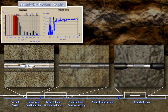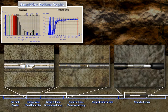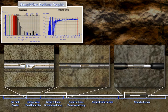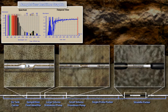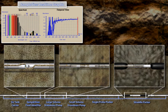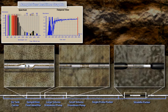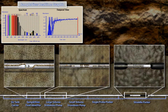The fluid can then be diverted into a sample chamber for retention. In order to obtain accurate PVT analyses, it is essential that the collected samples be as clean as possible to be representative of in-situ conditions. In addition to the optical density measurements, fluid identification of methane, liquid hydrocarbon, and water can also be obtained. The graph on the left shows a spectrum of heavy oil. The graph on the right shows a representative sample cleanup over time as the sample view response of a channel levels off, as well as refractive index. High-quality samples are essential for PVT analysis and intelligent completion decisions.